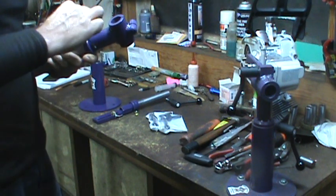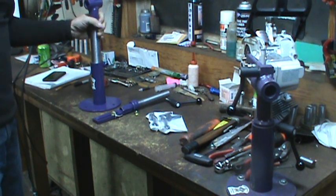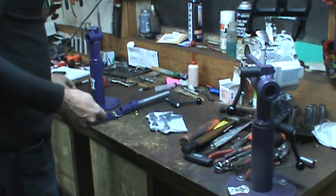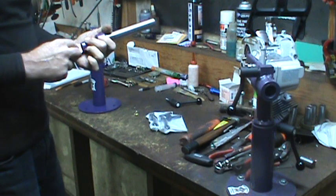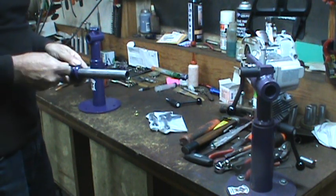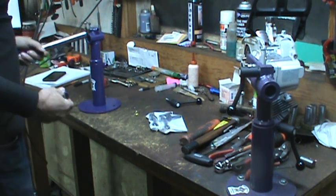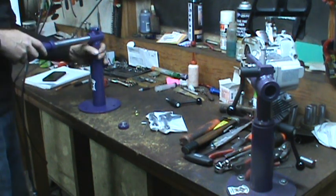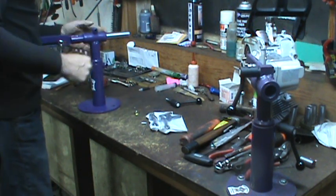However you're going to use the thing, that's all up to you — personal preference. I'm making it adjustable so you can get some adjustability out of it to suit your purposes. This comes with a bar nut — again, eighth-inch Allen, and it has a flat spot as well. It slides in here. Again, these are dry, so put some oil on it. Set screw goes on the flat spot.